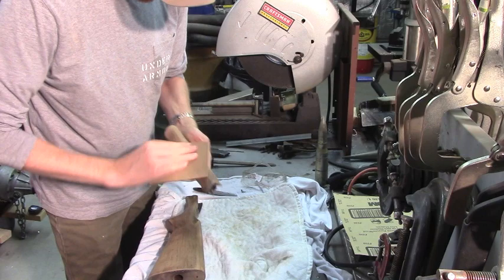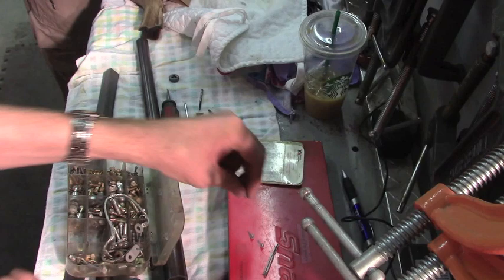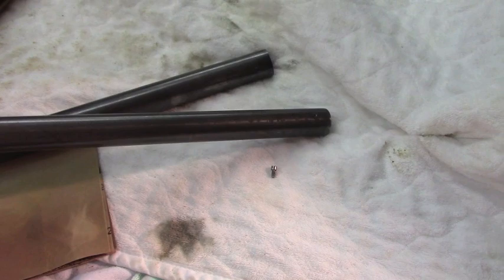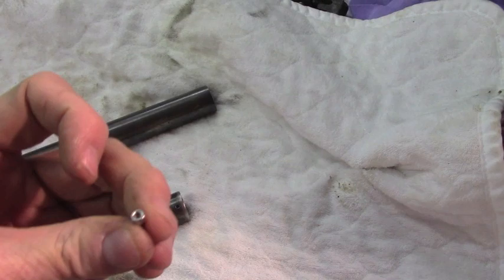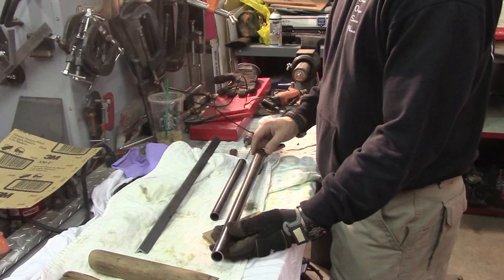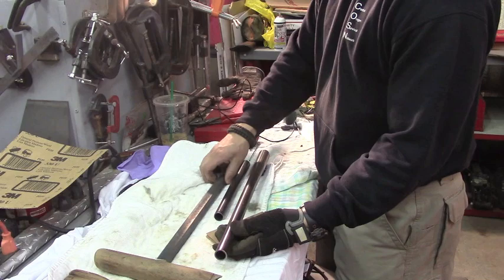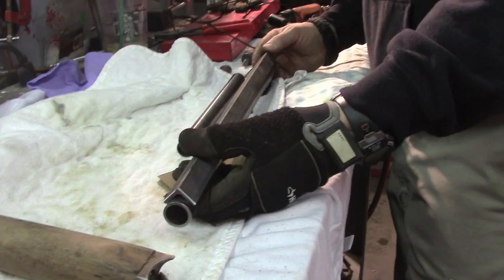We're going to attempt to turn one of these screws into some type of an aiming point for the front sight. We just practiced this on the piece of barrel section we cut off, just in case we messed it up. Todd drilled and tapped a hole in here and we found this little machine screw that's going to be our front sight. To get it perfectly aligned to the flat part on the back of the barrel, we cut a piece of angle iron — since it's pretty well trued — and we're basically going to stick this piece of angle iron on here, line it up on the rear, and that'll bring us right on the money on our front sight.